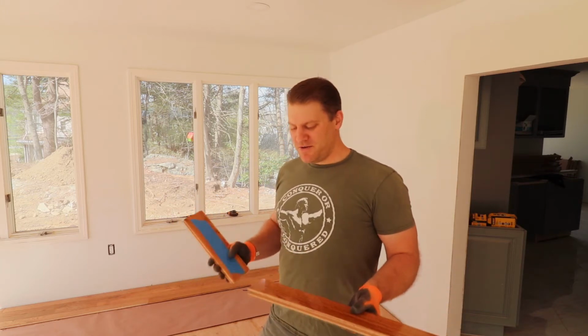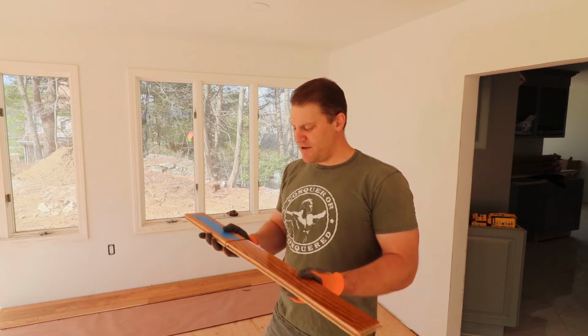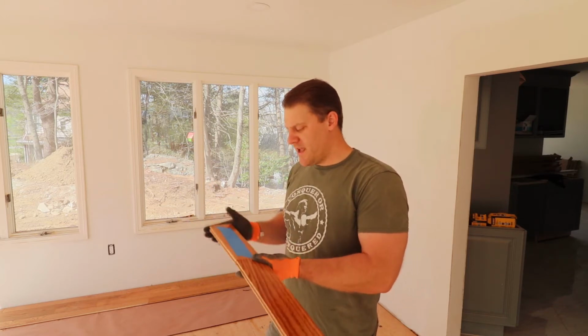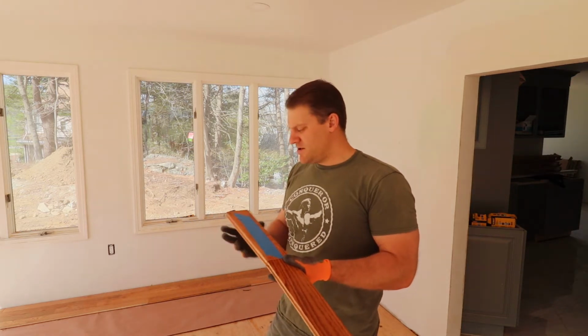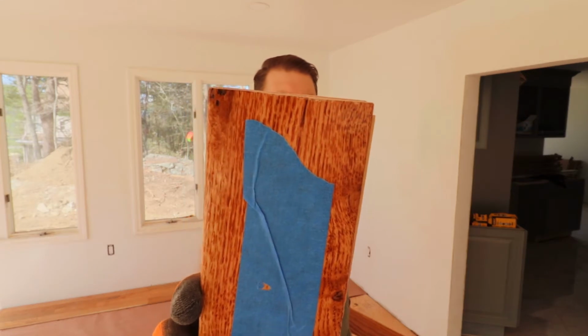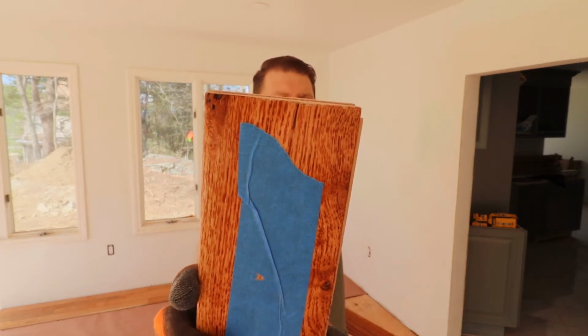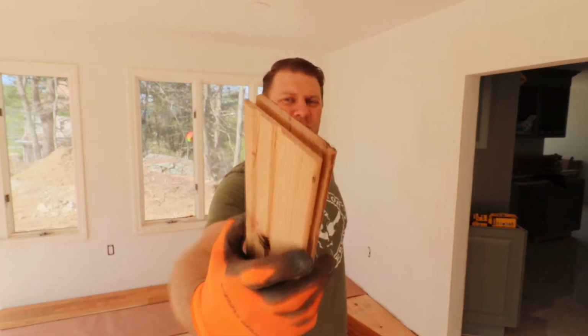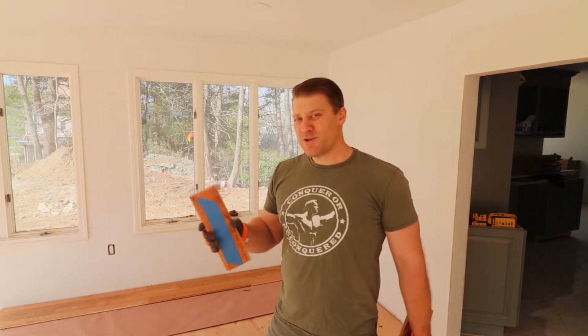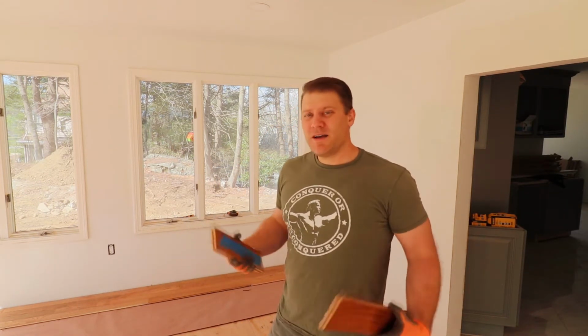So what I do is a sacrificial board. If I had to tap anything in, say it's in the groove and I gotta move it that way, I get the sacrificial board and tap it in with the hammer here. You can see this is where it's tapped, but you might be able to see the actual finish is a little grindy or ground down looking. That's from the floor hammer, the mallet. Sacrificial board works great. Just carry it in your pocket and go like that.